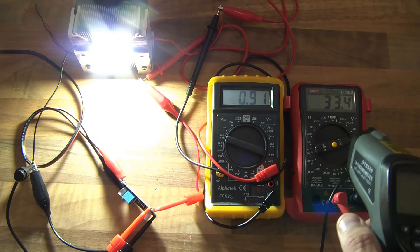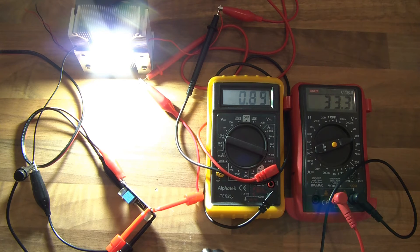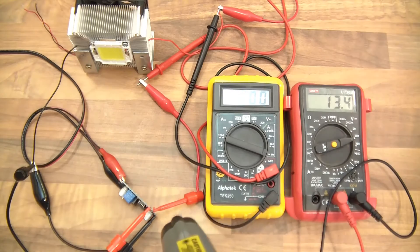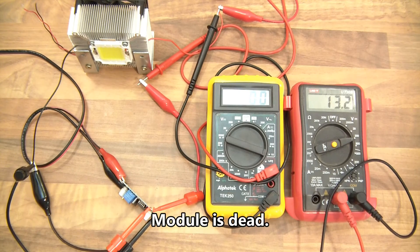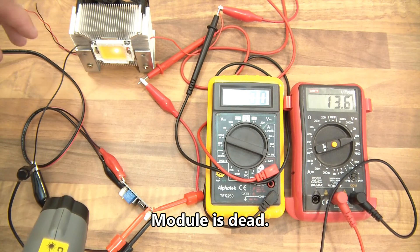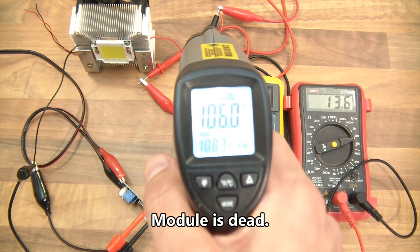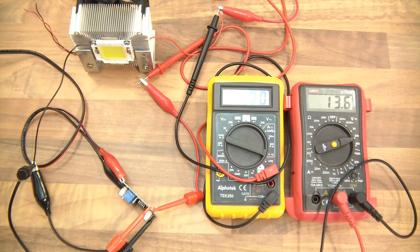It'll be the amperage which is the limit, not so much the voltage, I don't think. It's dropped and the light's just gone out. It could be that the LED's just overheated — no, the LED's not overheated. Let's check the diode. Wow, the diode is 106 degrees Celsius. I'll switch that off now. I may have just blown the third module. I think certainly the diode's destroyed.